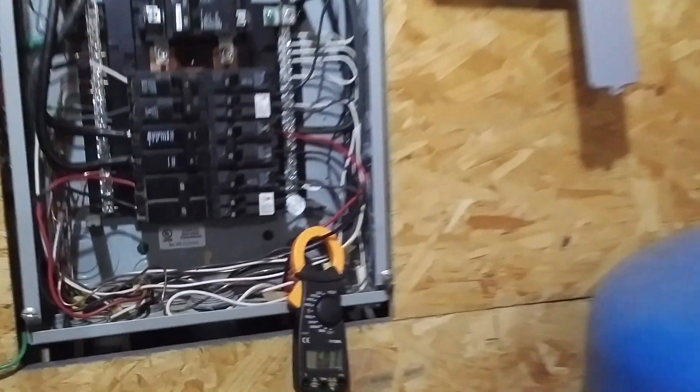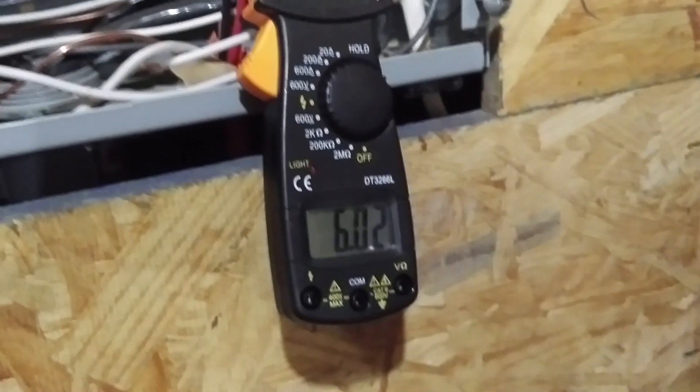So what are we doing? We're taking 230 single-phase out of the wall and then 230 three-phase. So there's a little power drop there going from single-phase to three-phase. Looks like 6.1 — we're drawing six amps.